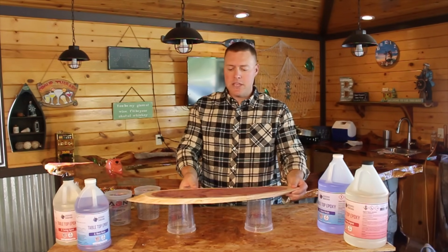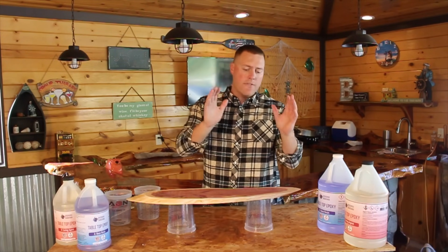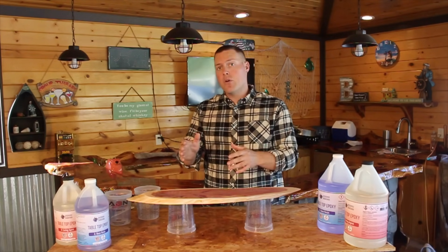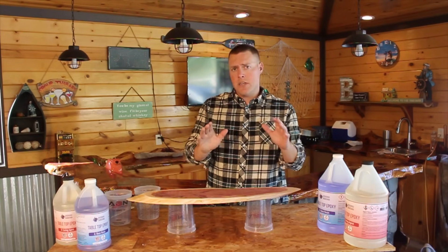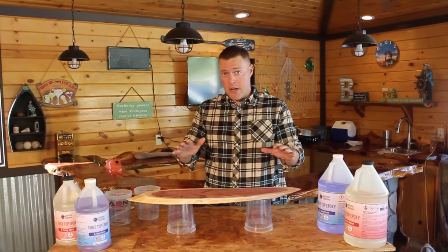It's really, really important because each piece of wood is slightly different. Cedar is different than oak, is different than pine. And even furthermore, each cut is different — so you might pour a piece and it is all well and good, and then you get a different piece which is slightly different. So always pour a sample piece or a sample area before you go pour the entire project.